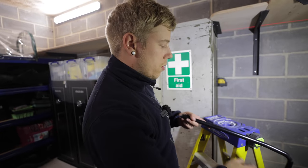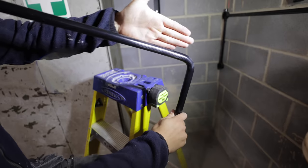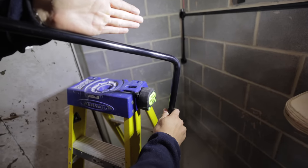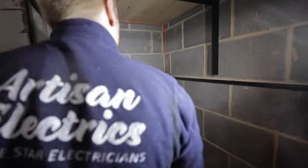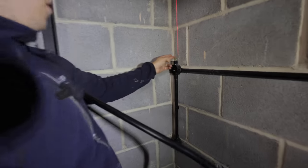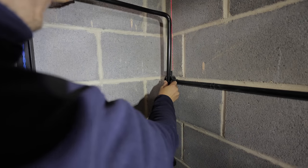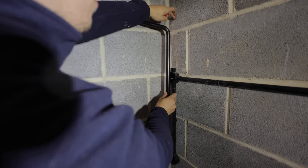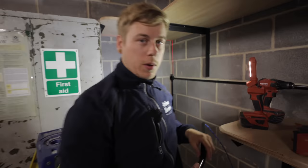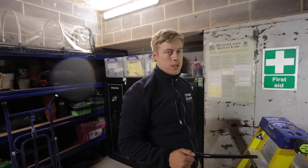On this bit I've had to do a 90 degree but then put a kink in it because where the T-junction is it's not flat against that wall. So when it goes up through the shelf it's not going to sit flush, but with the kink it'll be straight and just kick out back to that line. That's the good thing about bending spring and plastic conduit - you can manipulate it to where you need it to be.